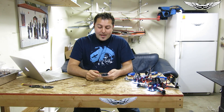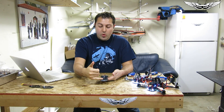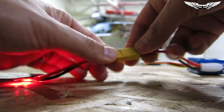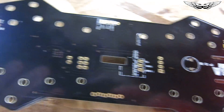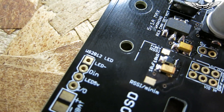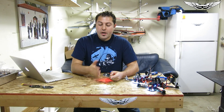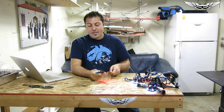Flipping the board upside down, you've got a total of 8 LEDs on board. These are really nice and bright LEDs. These LEDs are semi-programmable — I say semi-programmable because there are some traces that need to be either grounded or shorted out together for the LEDs to work. Or you can use the port on the side called the WS2812 port, and you can have a LED programmer in there to do things like turning on and off when you activate it through CleanFlight or BaseFlight — however you want to program those.